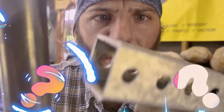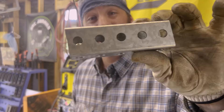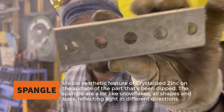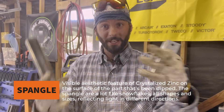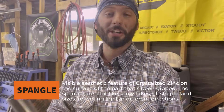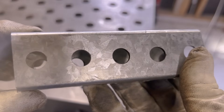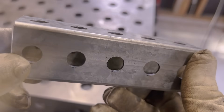How can you tell which one's steel and which one's got galvanized on it? Hot dip galvanized is your most common version of galvanizing steel or iron, and it's that dipping process we just talked about. It gives off these spangles — that grain that solidified so quickly that it just got stuck like that. You can go walking around and see all the galvanized stuff out there, and now you know those little different reflections on that pattern. It's the grains of that zinc. And the more it oxidizes, the more bold it gets. So you know if something's been sitting out for quite some time.